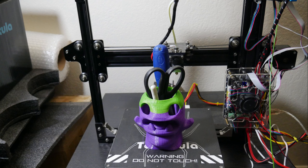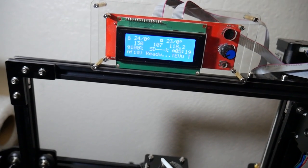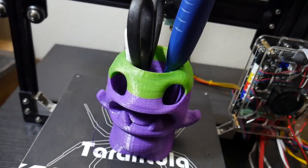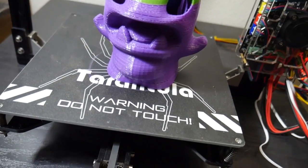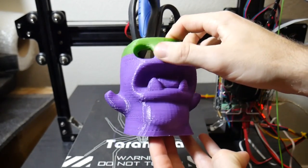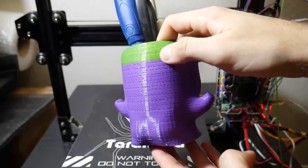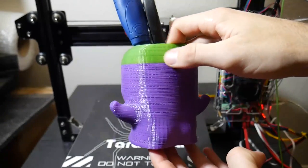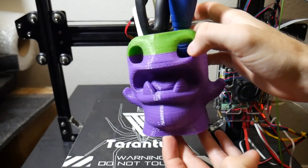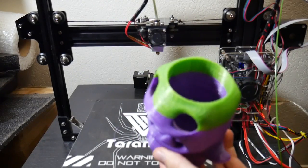Here's the end model. It seems like the printer is definitely still under-extruding, a lot less than with the Titan extruder, but I will have to go into the settings and calibrate to make sure it's actually printing the correct amount. I'll need to mess with the steps on the extruder motor and then go from there. That's my first step, and then I'll do some more fine-tuning and tweaking — again, this was just assembled, leveled, and hit print, and there was the firmware change which could have had an effect. But not a terrible print. It is really solid, but it is under-extruding, as you can see. By the time the review comes out, that will all be dialed in, and I'll tell you guys exactly what I had to do to get the print quality looking better.